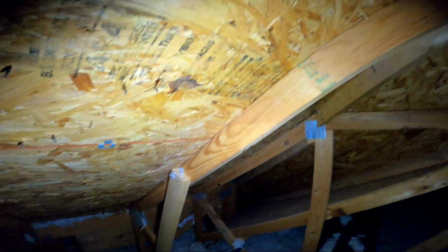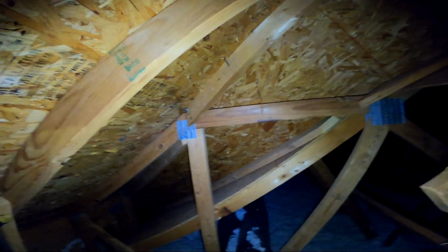Then there was one more thing I wanted to show you, and hopefully I can get to it quickly. I cut to it pretty quick. I had mentioned the area between the wall that you could see down, and I wanted to show you that's the partition wall between the closet and the bathroom. You can see how that wall is also open to air, with warm air escaping in the winter, and warm, humid air getting into that space in the summer.